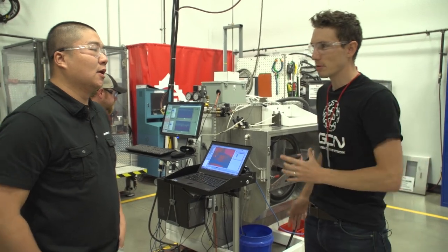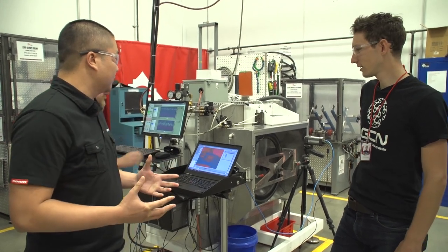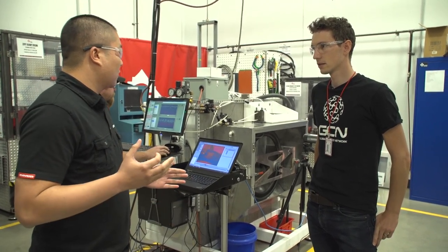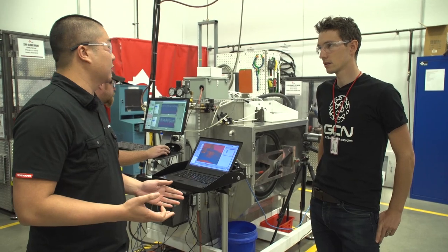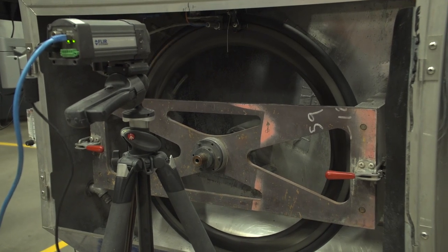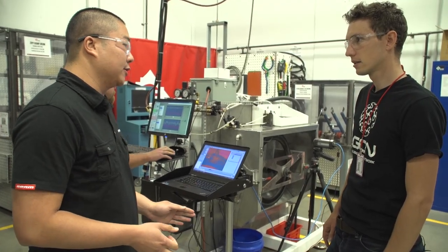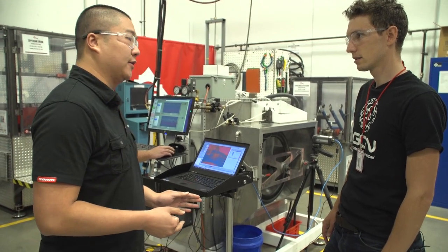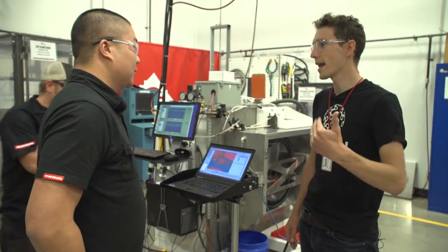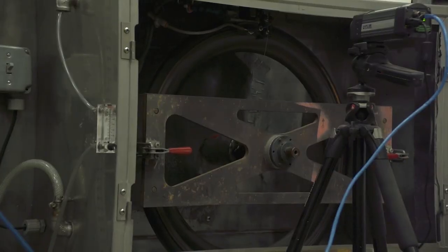This next one is going to be even more explosive. Here we're doing brake testing — we call this our slow burn. We're really looking to make sure the wheel is going to hold up and withstand all this braking; say you're going downhill and on the brakes. We're putting heat into the wheel and looking for delamination or any cracking. We're simulating worst case scenarios — a known wattage, known brake force, going pretty fast down the hill with consistent braking. We do a lot of field research to make sure we're testing above what our customers may take it to.